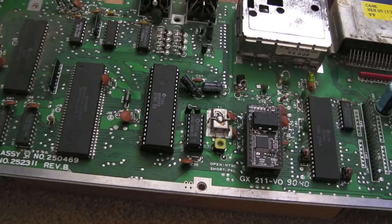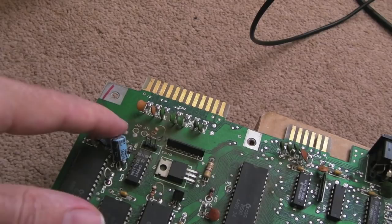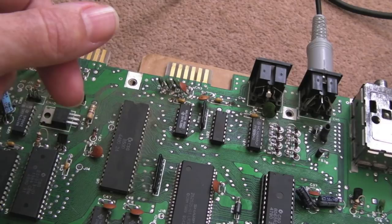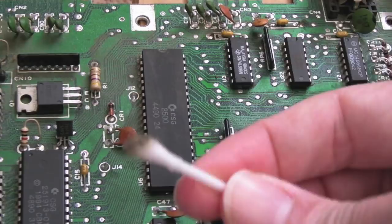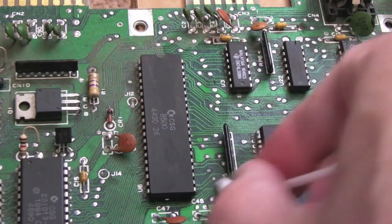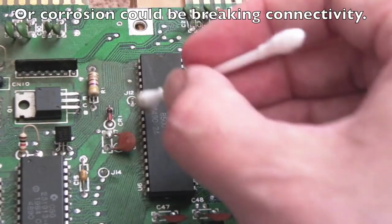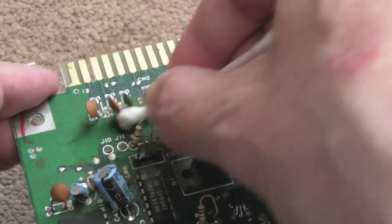It's just the same after the IPA clean. So I think what I'm going to do next is continue cleaning - certainly around the cart slot, these jumpers here, around the CPU, and maybe just down here around the PLA, just to make sure we haven't got any problems there before I try a new VIC. Just using some IPA here - you can see how dirty that is, it's absolutely filthy. It could be a corrosion thing, but I may need to remove that VIC socket. There's no telling what state it is underneath - we could have just a little bit of corrosion making some conductivity between a couple of the pins.